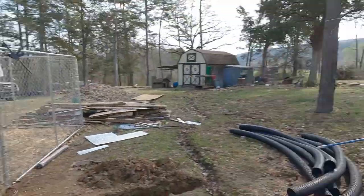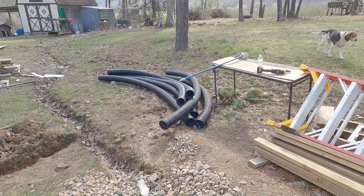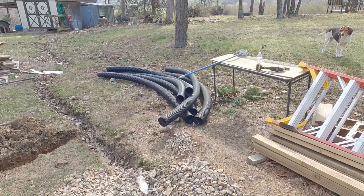A subscriber sent me a link to watch some videos. Actually, the holes go on the bottom, like on the bottom of the sides. I was always under the impression they went on top, but they showed how it works, because when it rains and the ground gets saturated, the water goes down in there and it soaks up from the bottom and it pours right out. On this pipe I have here, you can put them all the way around, but I'm just going to put them on the sides and we'll get it in there. We'll make sure it works.